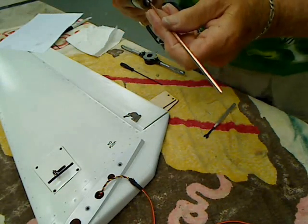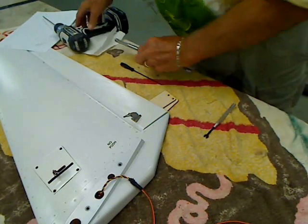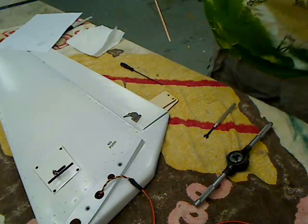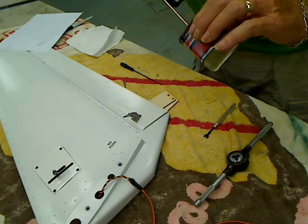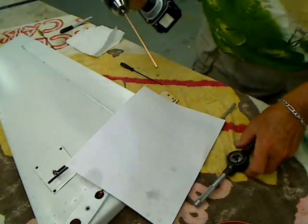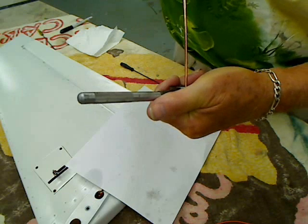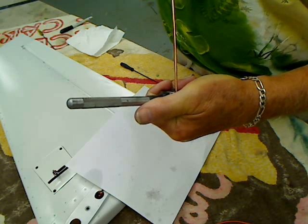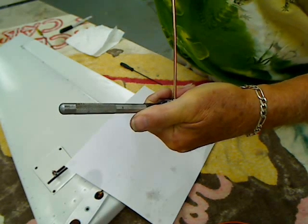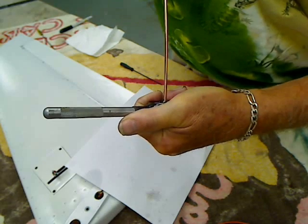The way we're going to do that is put this in a drill. We've got a 4-40 die here that we're going to use. First thing we'll do is put a little tapping oil onto the rod. Now very slowly, with a lot of pressure, we'll push into this and get this started. Make sure you've got a good bunch of threads cut. And you can speed it up just a little and let that cut.